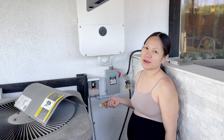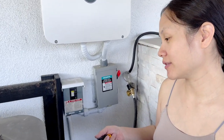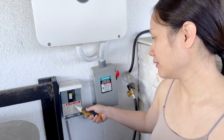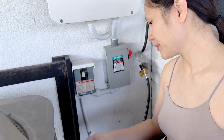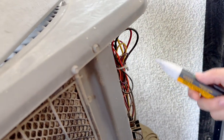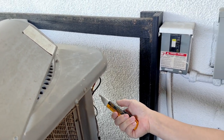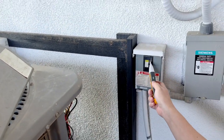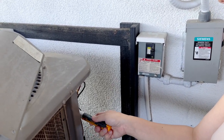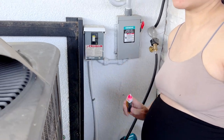So very important is to check that the electrical is off. We want to make sure that everything is safe — we do not want to get shocked and die. So we're gonna turn this off, and then follow the whip, and then check in this area. Open it up, check it, and make sure it's completely off. We're checking this — make sure it doesn't beep. If it beeps, then it's on and you want to turn it off. Right now it's off — no beeping.